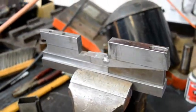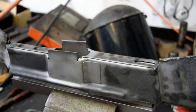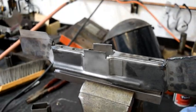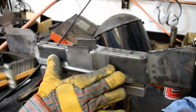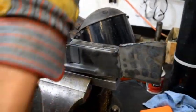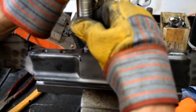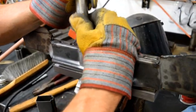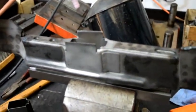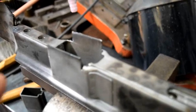The first step is to put a receiver that we've spot welded onto the block. Keep in mind that the VG15 was a dominant hand-made gun and there's a lot of hand fitting in the process. You tap the receiver onto the block and it's going to need a fair amount of touch-up work, because while the receiver was machined, it's sheet metal pressings and you'll need to do the touch-up work to go to the next phase.